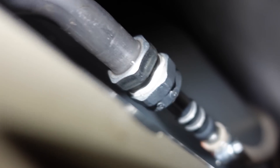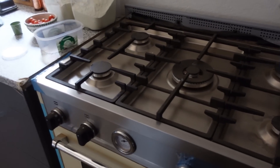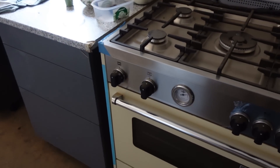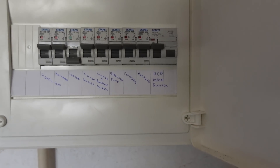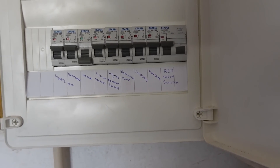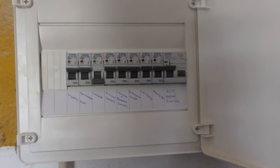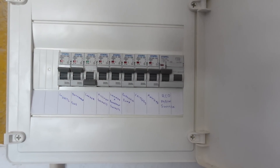That's now usable as a gas cooker on the hobs at the top, but obviously we won't be able to use it as an oven until we get the electrical system checked. Something's gone wrong - I don't know whether the builders have done something or whether it's a fault on that particular cooker fuse. The cooker breaker is turned off; it didn't trip the RCD either when I touched the earth and live on the back of the cooker and got a little buzz. I think all I can do is get the electrician to check it.